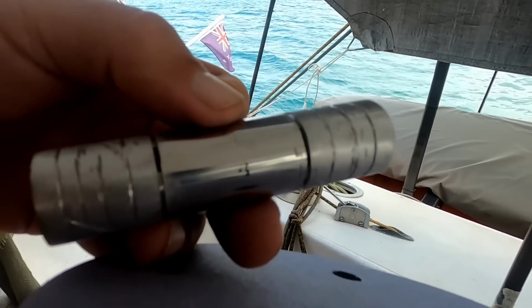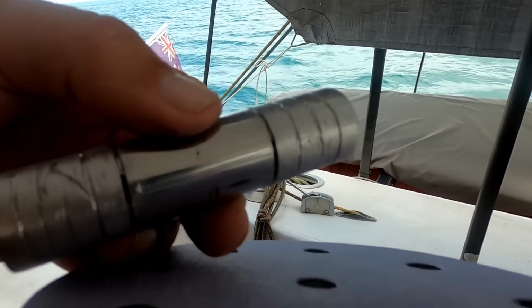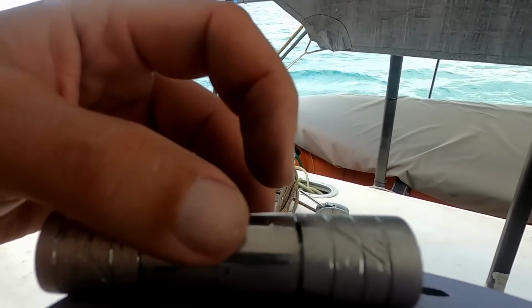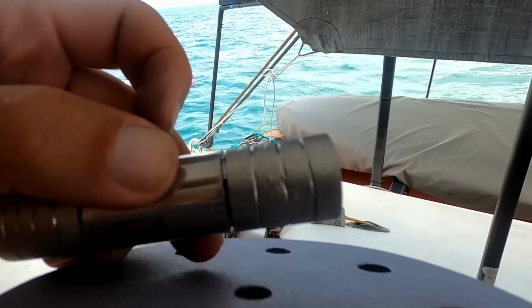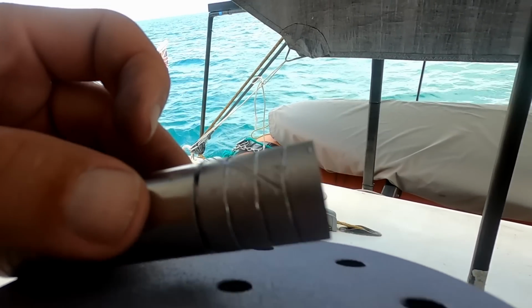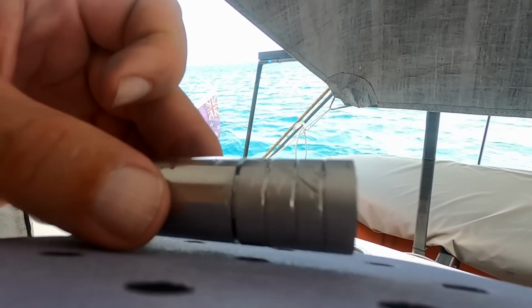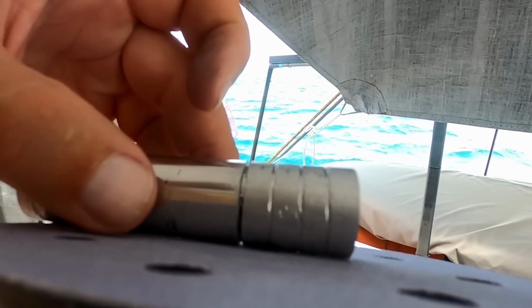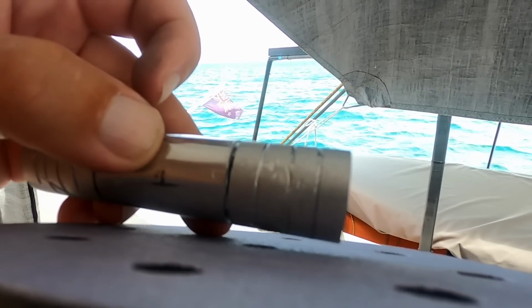And is that etched and stuff to help it bond to the carbon? Yep. So to stop it from being ejected out the side, because normally I'd have a cotton reel machined up which would have big shoulders on it, but I don't have that available here in El Caribe. So I'm just using a stainless steel sleeve, but I've put grooves and slots and stuff in it to stop it from potentially rotating and being ejected out the side of the chain plate if it ever tried to break. Well, just trying to stop it from ever breaking loose.